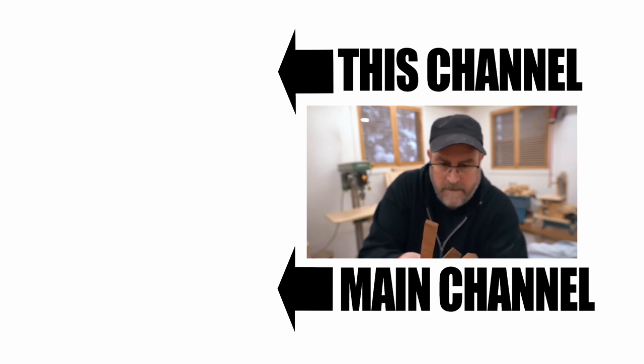I do like the ash though — that really came out nice. And I like the cherry and the maple — all three of these are awesome. I need quite a bit of it because I want to possibly make a pair of speakers from torrified wood. That'd be perfect because it'd be solid wood that is absolutely stable and won't expand and contract, which is what you need for speakers — you put a metal speaker inside a wooden frame and need to make allowances for expansion. It would be interesting to make enough in my kitchen oven over the winter to build a pair of speakers.